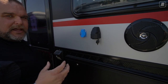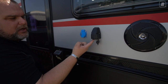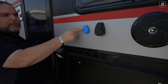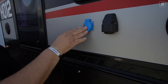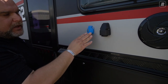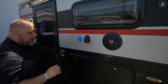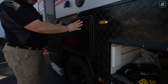We have two plugs here. The black one is a marine-grade 12-volt plug with a rubber cover — you can plug in a cigarette-lighter accessory or a small inverter. Next to it is a blue GFCI plug — a ground fault circuit interrupter. To use the GFCI plug you either need to be connected to a generator or a 30-amp shoreline; it will not work off the inverter.